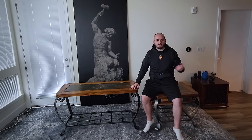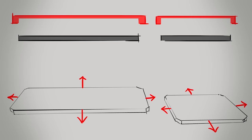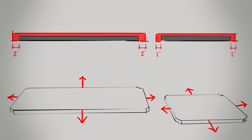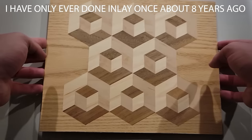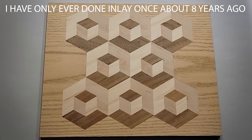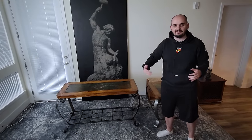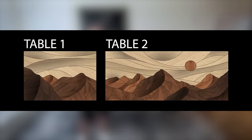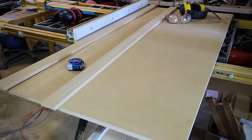So let's get building. I'm going to make these tabletops a little bit larger to have a couple extra inches on all of their sides. The idea for this new top is to essentially make it like a hat that can just slip right over top of the old one. I can use less material and cheaper material like MDF as the base structure, then cover that with veneer afterwards and make this whole thing like a marquetry inlay project. Since I have two tables, it would be cool if the veneer inlay made one big picture between the two when they're sat next to each other. I'll throw up a mock-up render on screen for whatever future me decides that will look like, but first we need to build the base structure.